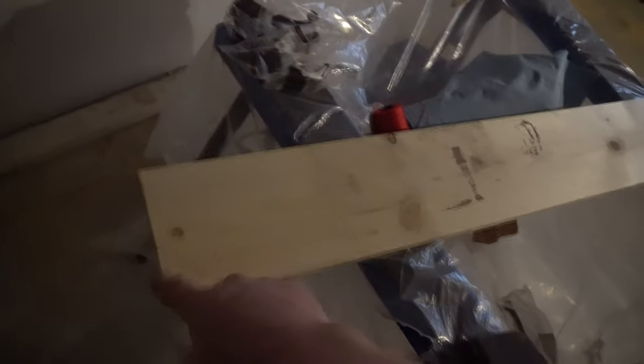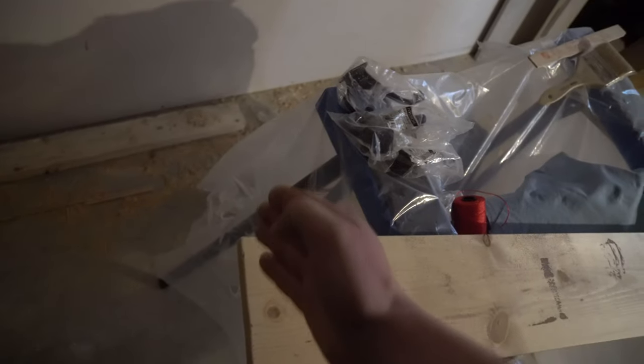After you do so, and we've cleaned this up, you've sanded it, if you want to, you can go with another finer sandpaper. For me, I'm looking for a little bit of a rustic look. The other thing to look for is if it's got stamps or anything on the side of the wood, and then either cut that end so that way you don't have the stamps. You might have to cut both ends. But just make sure that you mark your line, either cut it with a handsaw or cut it with your circular saw.